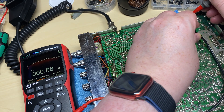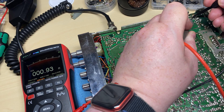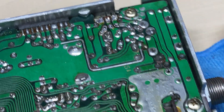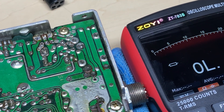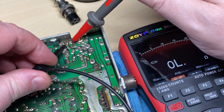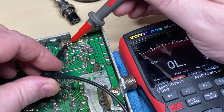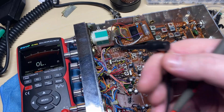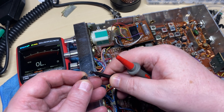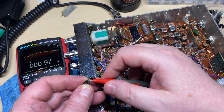As I was doing the FM power I noticed I couldn't adjust it and I was getting 16 watts on FM. Sure enough it looks like the 2SA1012 is short, but somebody has replaced it with a TIP transistor. Disconnecting it and measuring the actual transistor it's not short - it looks like the transistor that controls it is short. Going across the desoldered transistor legs we have a short circuit. So yeah, 16 watts on FM - that won't have lasted very long. The transistor is doing a good impression of a piece of wire - so that's another fault.